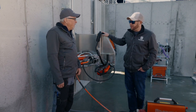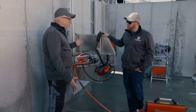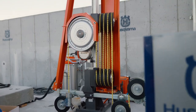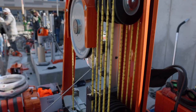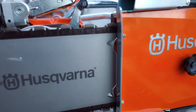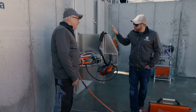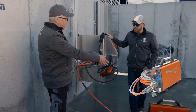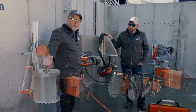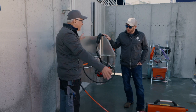What kind of blade capacity can we run on this saw? This saw is capable of spinning up to a 62 inch blade and anything in between. With the features built into the system, we can easily switch over to the CS10 wire saw, which gives us capacity to cut almost anything, and also the WSC40 chainsaw attachment so we can square our corners up quite easily without taking the saw off the track. And this saw connects to our 492 power pack, which is also capable of running all of our prime tools, with the exception of the WS220.